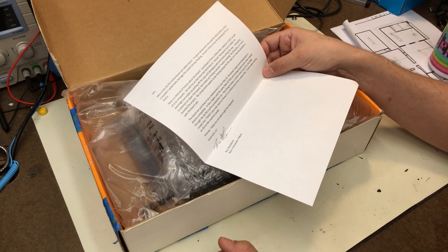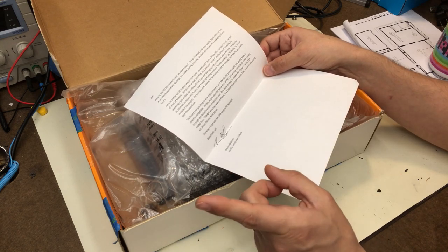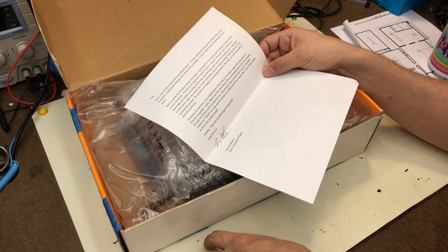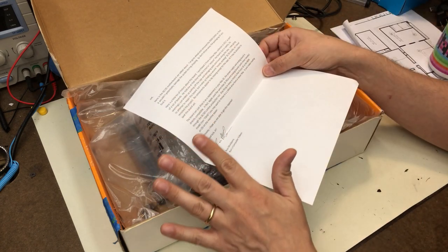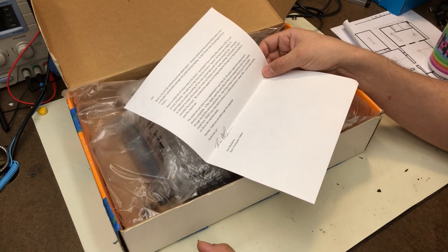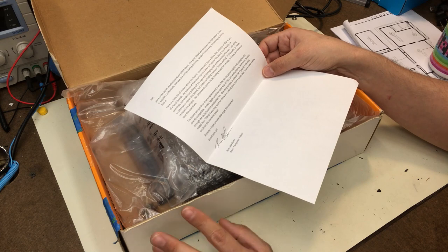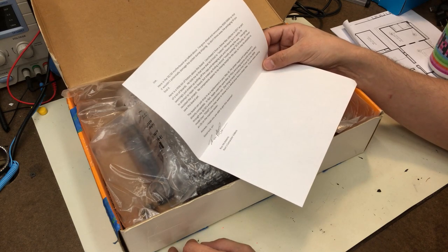One thing to keep in mind is that if your SE has an 800K model, you may want to throw in a 1.44 megabyte drive from a newer Mac. My SE actually is an 800K board with a 1.44 meg floppy drive in it. Very interesting set of circumstances there. I'll get into that in a little bit. It makes loading the OS on the machine easier. Yes. Anyway, I hope you're able to get this repaired. Good luck, sir. Ron McAdams from Ron's Computer Videos.